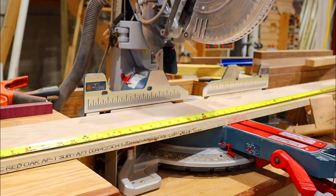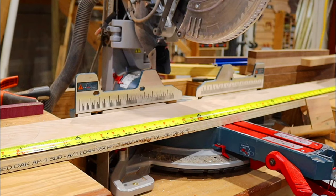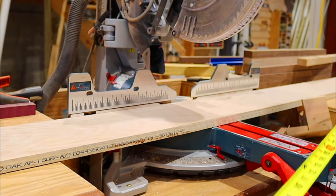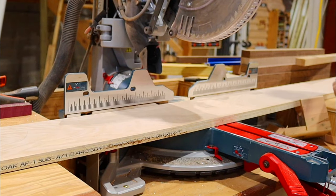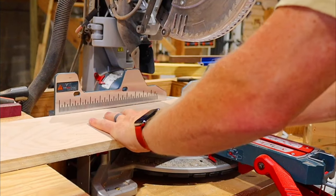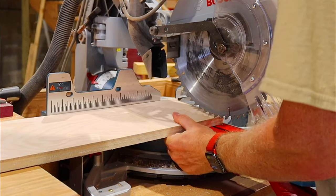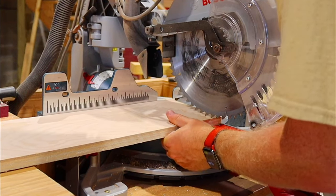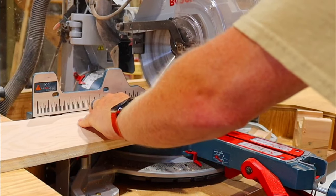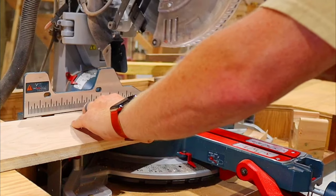A torsion top workbench has an internal grid structure that keeps it perfectly flat. You do that by screwing it using — in my particular case — glue and pocket screws on one side, which ends up being the top, and with deck screws to the bottom. Plywood, by the very nature of the way it's built, is very stable, so we're going to have zero movement in this table. Making it out of plywood is a unique choice, and when we put the structure together, we will have a perfectly flat top — barring making a mistake, like gouging it — forever.